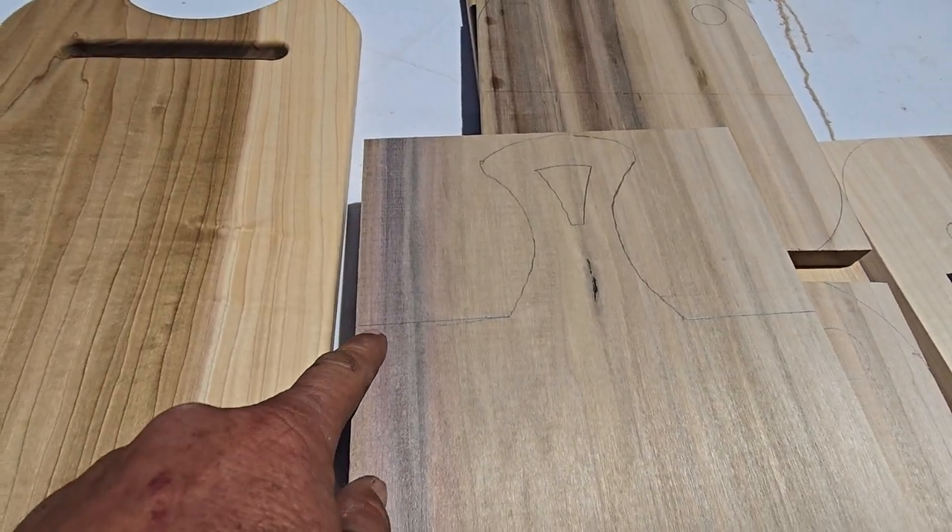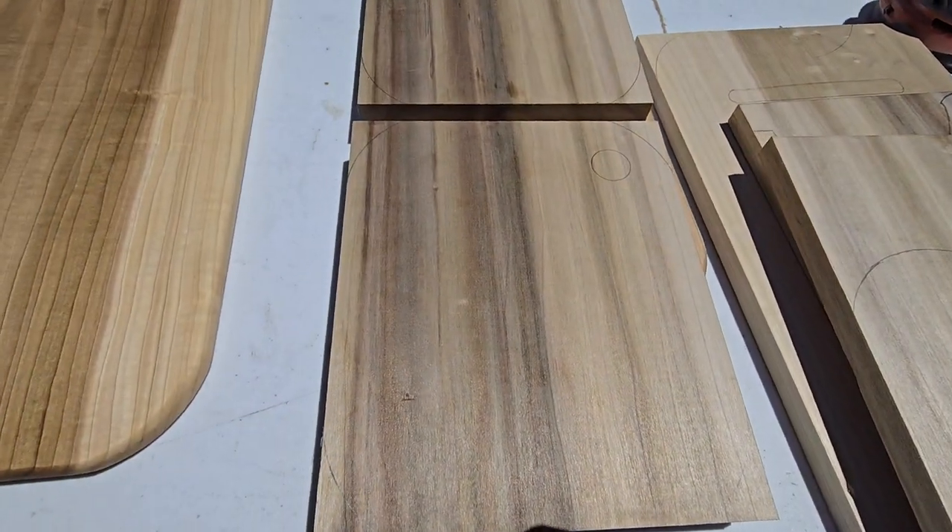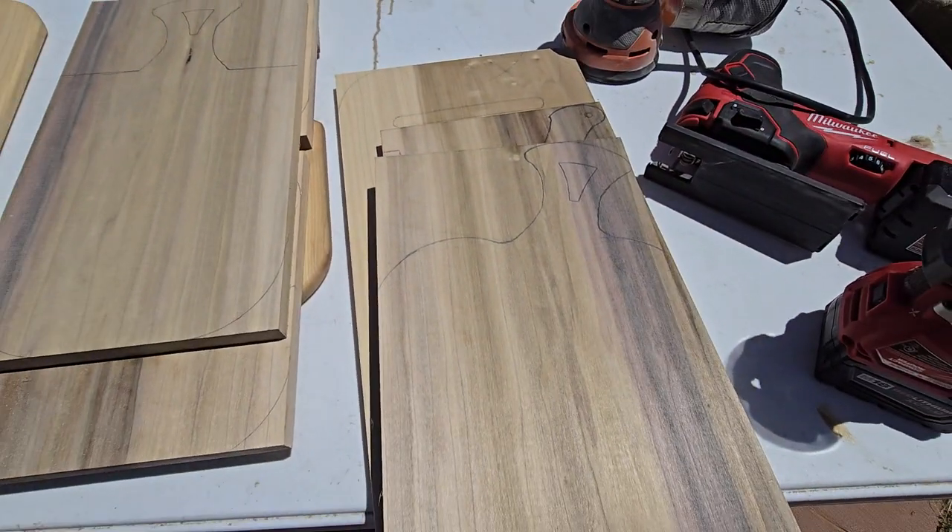You just cut them out with your jigsaw or band saw. Then sand the edges — I go through 80 grit, then 120, then 220. After the 220, I pop the grain. What that means is when boards get wet after they're sanded, the grain fibers raise up and the board won't be smooth anymore. After the 220 the board feels really smooth, but when it gets wet even after the finish, that grain is gonna pop up and feel like sandpaper. So you just spritz them with water and hit them with 320.